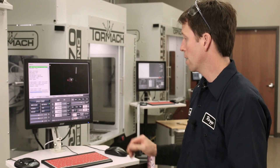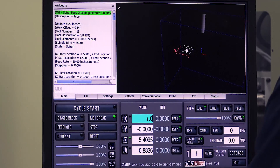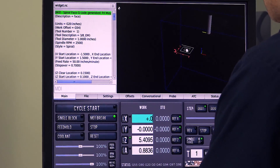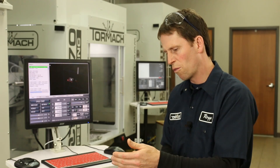There are a couple ways you can do that. One, just go ahead and enter in the xDRO — plus 0.002 is going to shift it over by two thousandths of an inch, no matter where you are. Even if my x position is something arbitrary, I could type in plus 0.002 and it'll add two thousandths to that value. That'll shift it over a little bit.